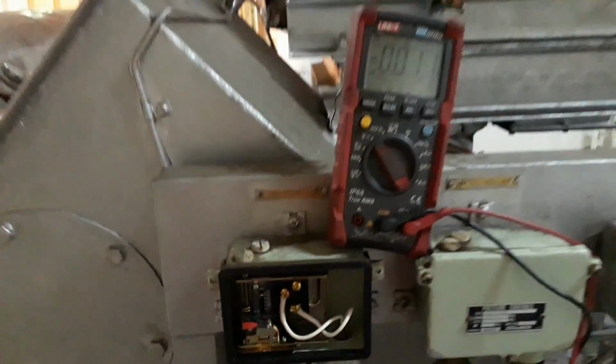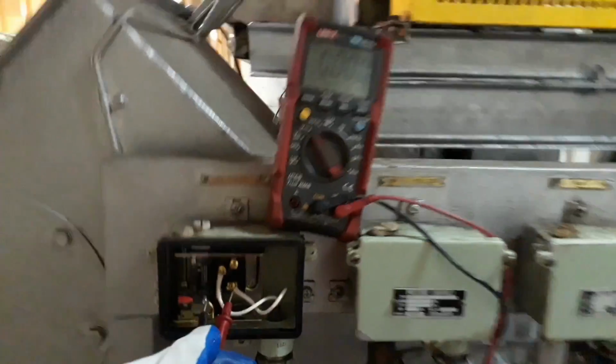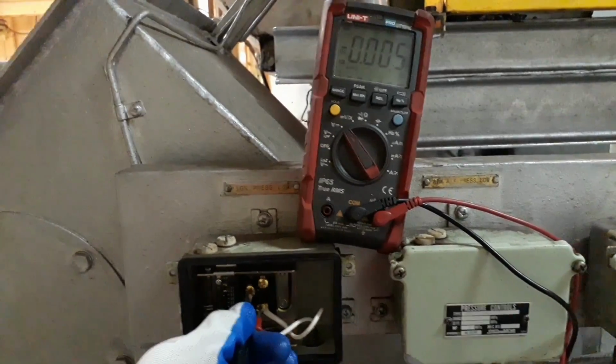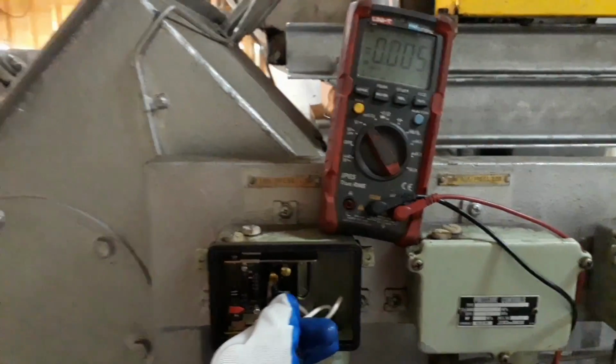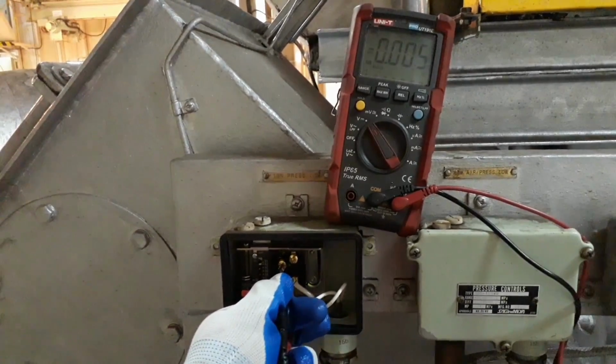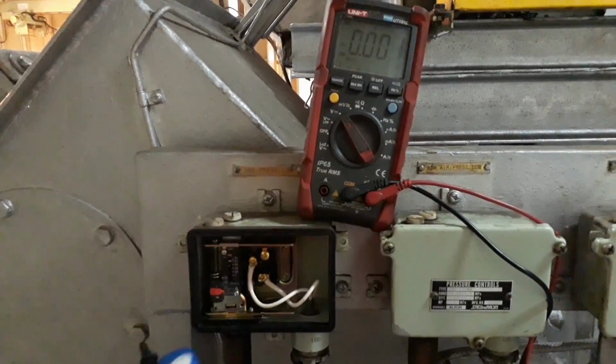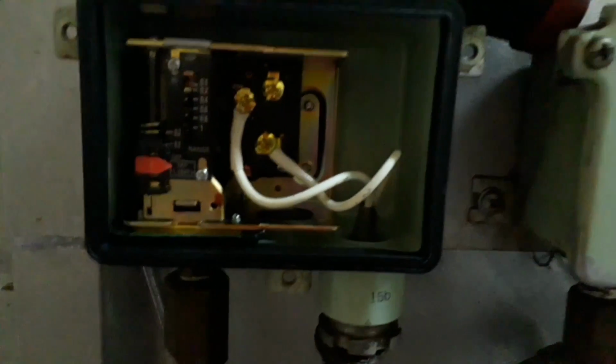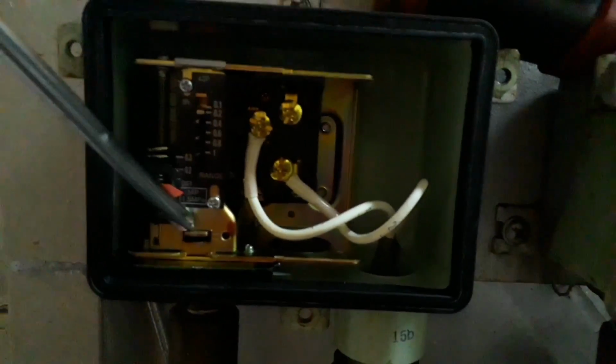Ignition pressure low alarm. The ignition pressure low alarm will come out when the oil pressure falls down to the set pressure value. So for example, our set value is 0.7 megapascal or 7 bars. I will just shut off the valve for our pressure supply, and when it reaches below 7 bars, the alarm will activate and shut down our system.